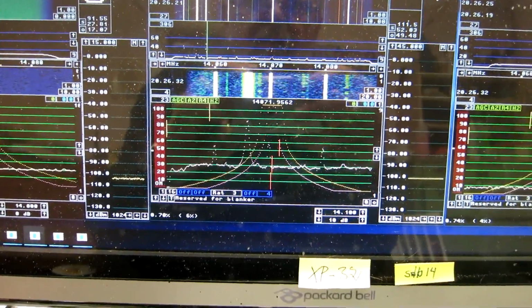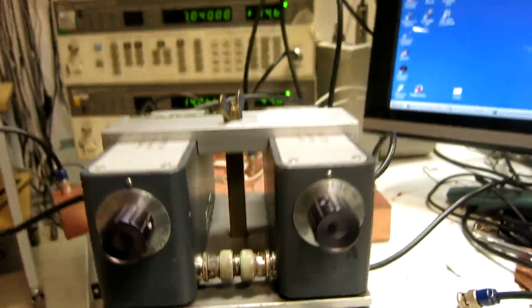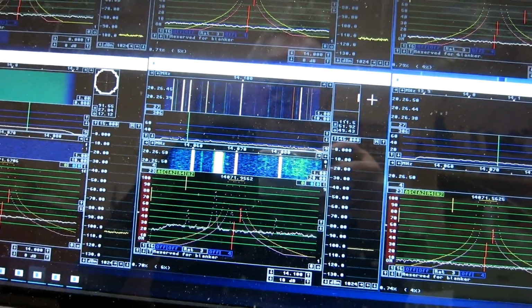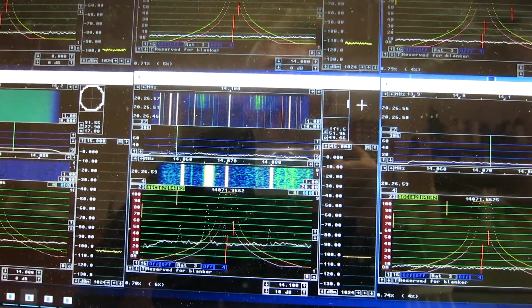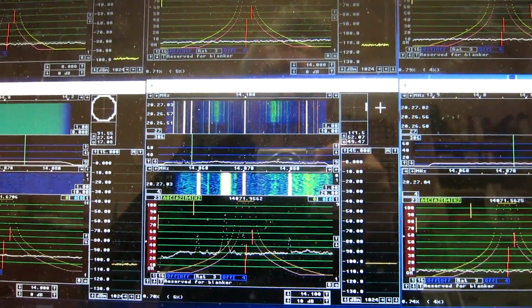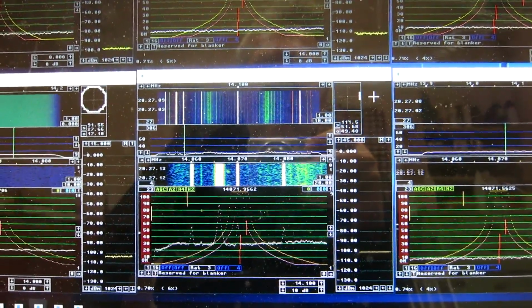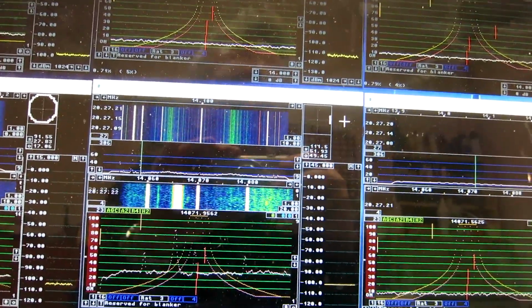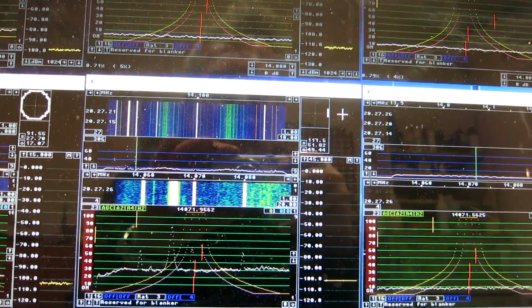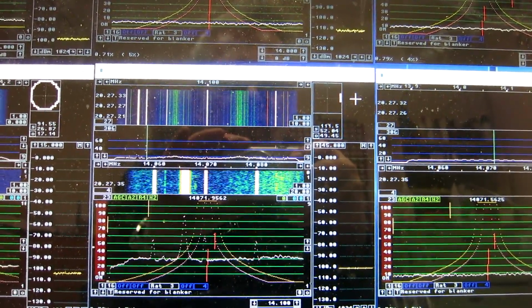This is the WSE converter. It's now -100 dBm for the sum frequency, and the signal level is -11 dBm. So if you note how much lower the noise floor is, adding a 10 dB attenuator in front of it would bring it to a similar level as the SDR-IP or the Perseus. Maybe it was intermodulation from the WSE that affected the previous measurement on those two. Anyway, second order intermodulation isn't so important, because if you need better than what you can get from these radios, an external filter to suppress something that is on half the frequency would not be very difficult.